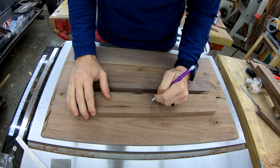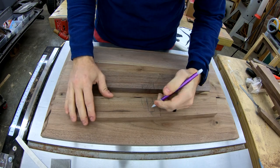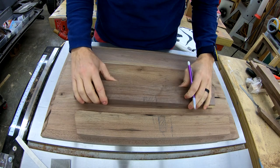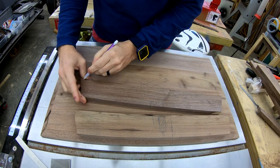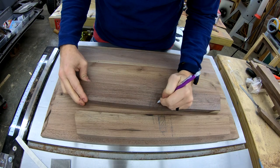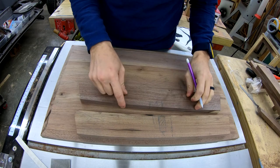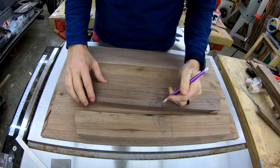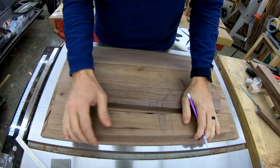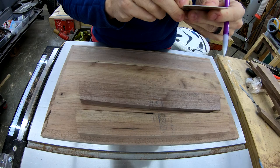and then my notch will be cut like this, and on this one I will take 5/8 of an inch from the top section, and I'll be doing all that with that same angle, that, what was that? 53 degree angle.